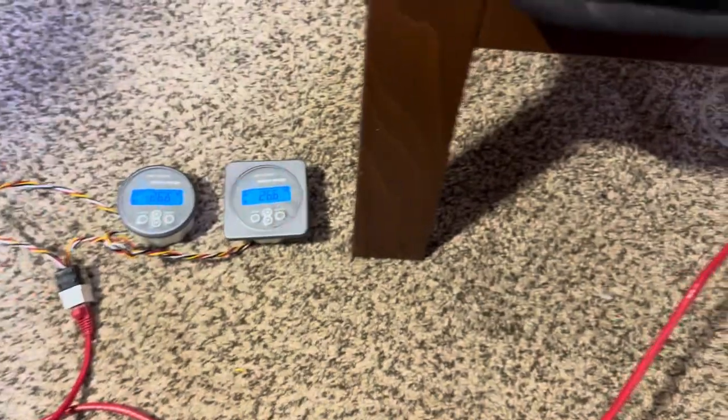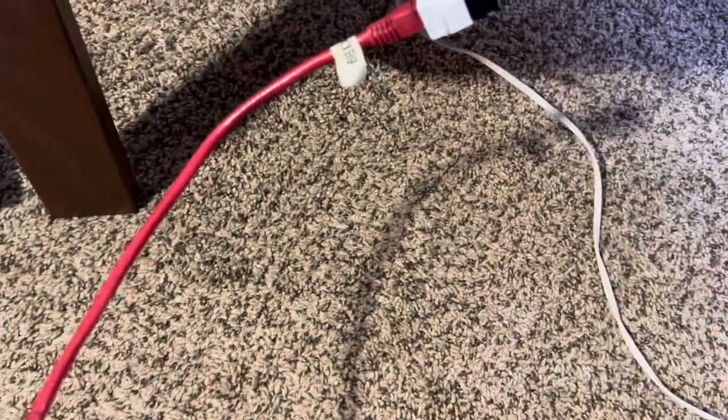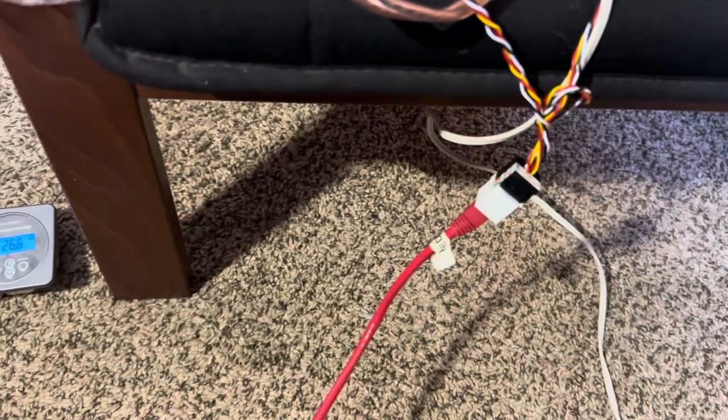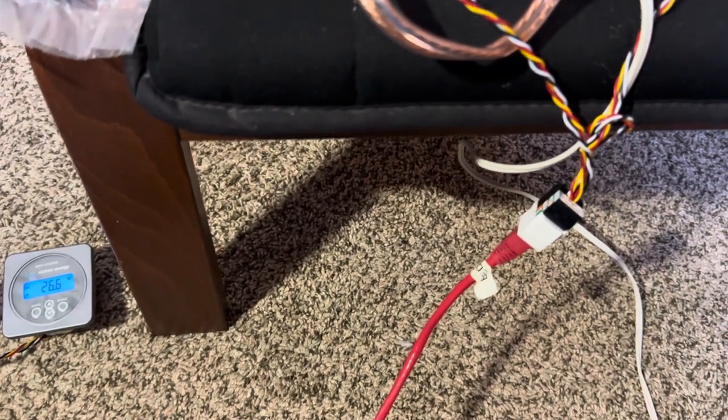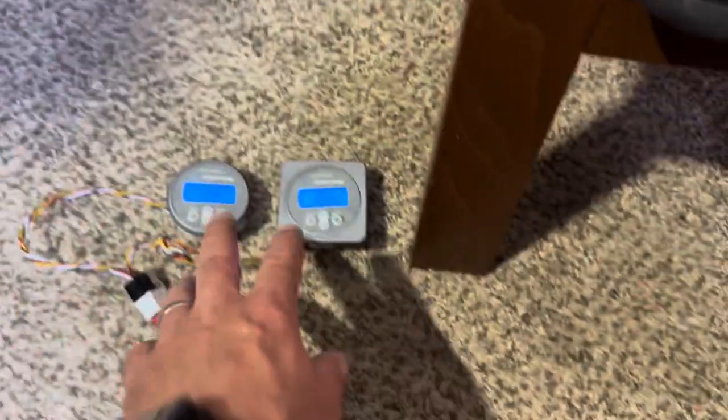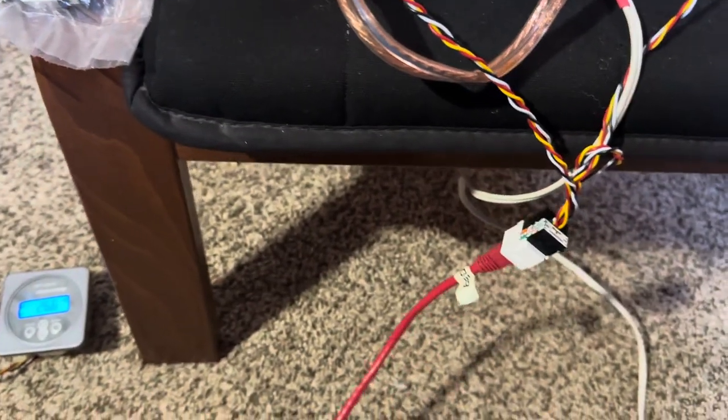The biggest warning would be: make sure you're using a straight Ethernet cable and not a crossover, because a crossover will flip the power and data lines all together, and it might damage this end — but that's kind of an unlikely thing.